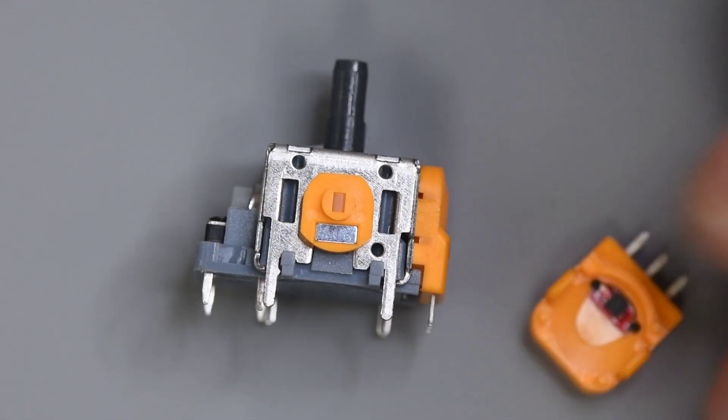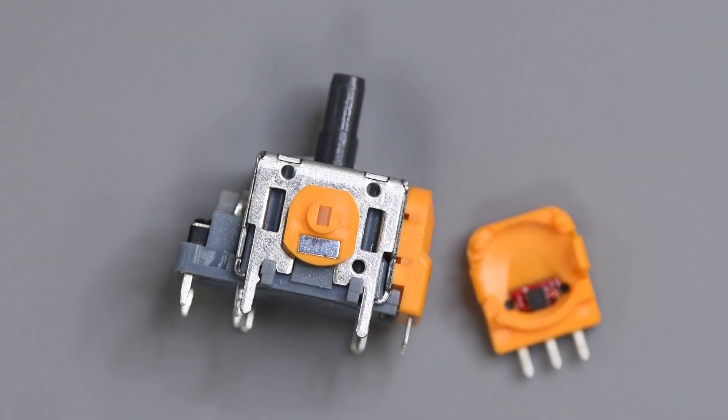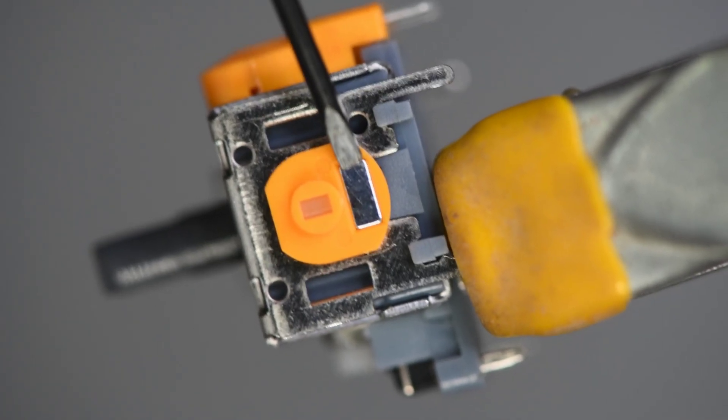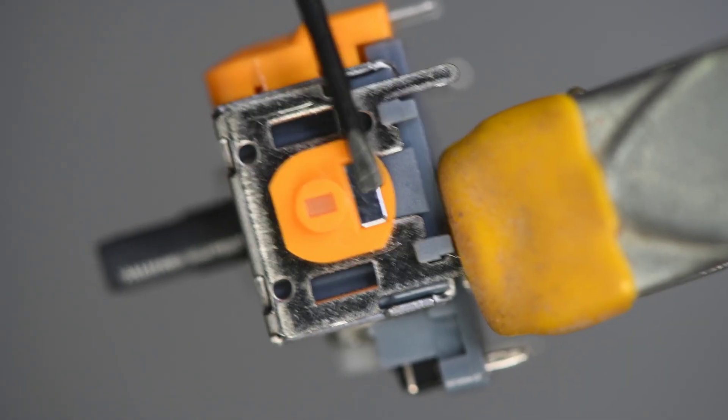There's a tiny magnet on the shaft and the Hall sensor is mounted in the plastic shell that snaps onto the joystick frame. The Hall sensor is a 6-pin package with 93L35 on it, and it even looks like it's mounted to a tiny double-sided PC board. That's a pretty strong magnet — probably a small rare earth magnet, so not the cheapest of magnets in the thing.